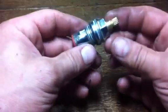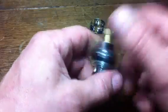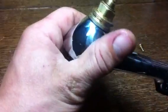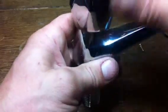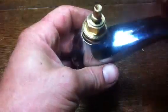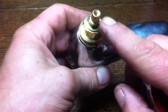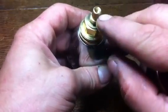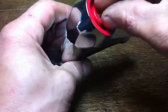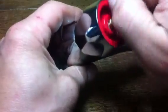So that's a new insert. Again, you're looking for, does it fit here, etc. And then the other thing with these taps is that quite often getting the head off can be tricky. So, for example, T or cross-headed taps. This one's obviously, the screw goes in directly downwards, but on cross-headed taps, sometimes there's a screw going in sideways into it. So just turn the tap head and have a look. Be prepared for a bit of a fight to get the head off. They're not that easy, and the whole lot goes back together. Obviously make sure it's all turning free and it's all nice, and that's you.